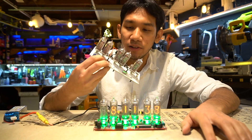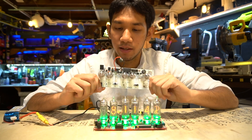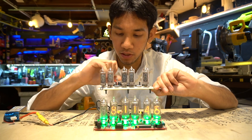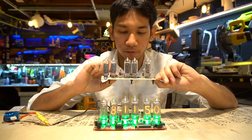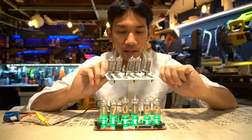I did start off with this clock over here, which you saw earlier. For whatever reason, when I plugged it in it all went to zeros, and then immediately the inductor on the board smoked. I tried replacing it with another inductor, but I think unfortunately some chip is fried in here. I may have to see what's up with this one later on, but I ain't got no time for that.